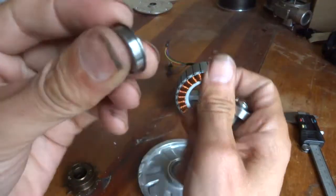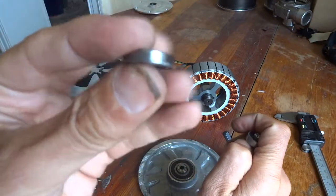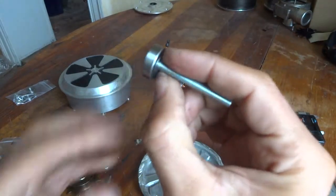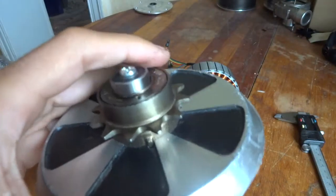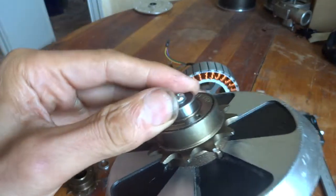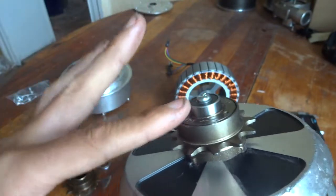This is very thin and the balls inside don't look like they'll really last very long. I would simply suggest you take one with 5 millimeter inside and 19 millimeter outside — the 19 millimeter outside goes quite nicely; it centers a bit because the bearing edges are softened.